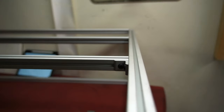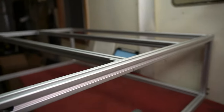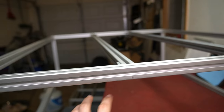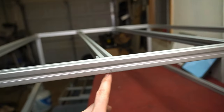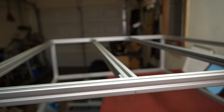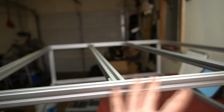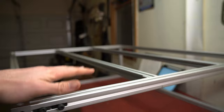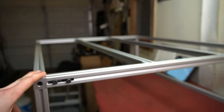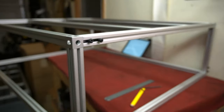All right, so you saw me do these top bars, kind of tilt it up on its face to assemble it, made things a little bit easier. I went ahead and did 32 divided by 3, since this is a 32 inch bar. Got about 10 and a half, so I put a mark here and here, same on the other side. Secured the bars, so it splits it up into three sections. The lid will have nice support. It's gonna be half inch hardwood plywood, so it should be plenty strong as is.